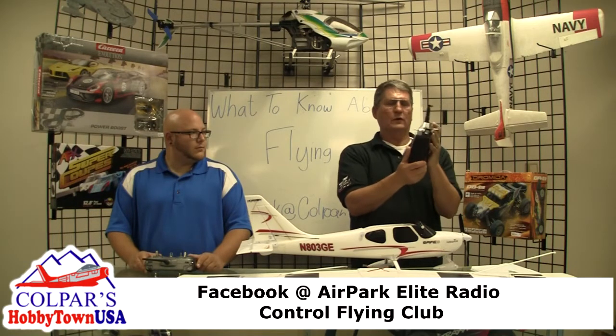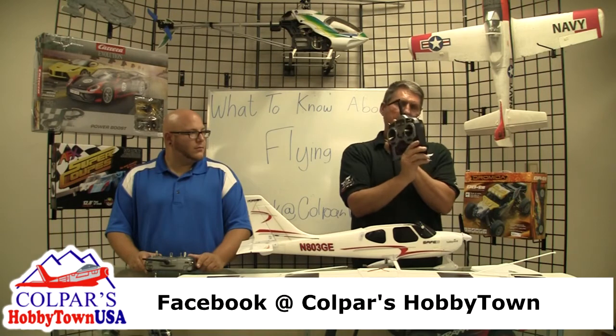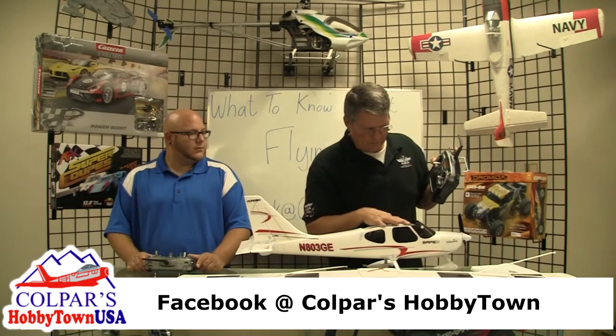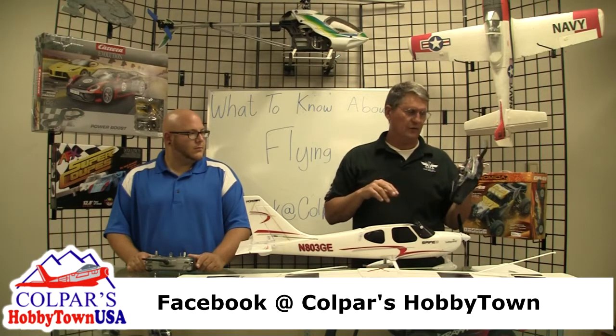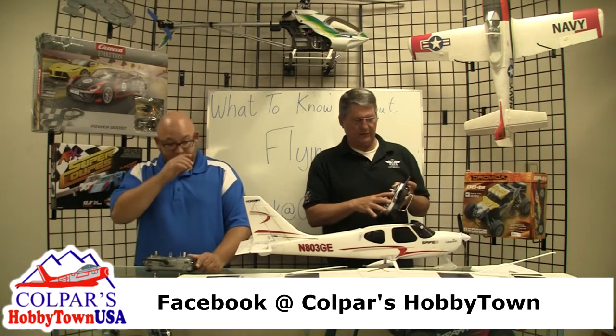Then what will happen is the DX5E will be blinking like that, and when that's blinking, the receiver will turn on to a solid orange light. That means at that point you can go ahead and release this one, and the aircraft is then bound to the transmitter.